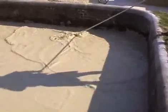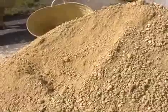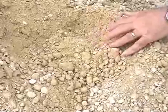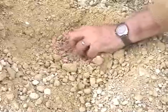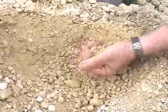We dump 1 ton of limestone rubble into the basin and mix it with the cement. Several days later, water has evaporated from the basin, so we remove the disaggregated limestone for making the block. Inspecting the mixture, 95% limestone aggregates and only 5% rock-making binder.